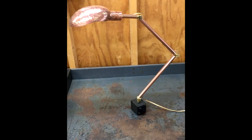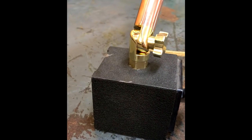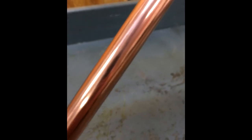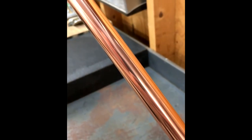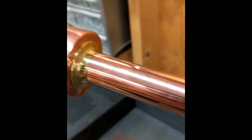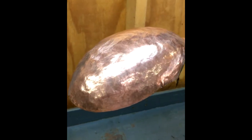So that's everything made. Off camera I used the buffing wheel to polish up each part. I also drilled some small holes so that the wire could be run inside the copper pipe. Assembly is as easy as using the thumbscrews to hold the arm segments together. From up close it doesn't have a perfectly smooth, mirrored surface finish, but that's not really what I was going for. I know it's going to get bumped and banged around, so I wasn't concerned with spending too much time on the finish. This is also why I didn't want to clear coat it — I know as is it will tarnish over time, but some metal polish can quickly brighten it back up. If I sprayed it with clear, I know that over time it will get bumped and spots of clear will chip off, leaving tarnish spots with no easy way to shine them back up without messing up the clear coat around them.